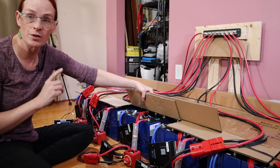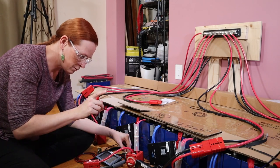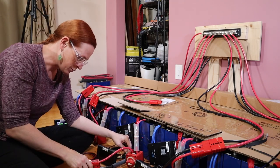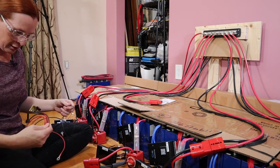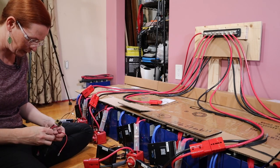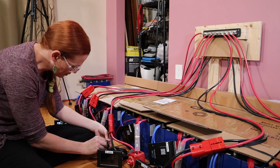Going back to ABYC — if those gases can be ignited at all, regardless of how likely, I need to plan for my battery compartment to contain spilled fluids, be vented in case of rupture, and use ignition-safe equipment. Finding a citable source would be really helpful — I've looked but haven't found one, though admittedly I haven't looked super hard because I've been busy. Also, Andy mentioned that these screens never turn off — these buck converters are not going to make it to my boat.